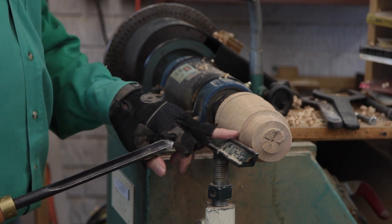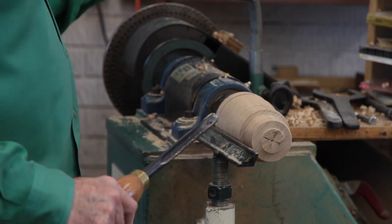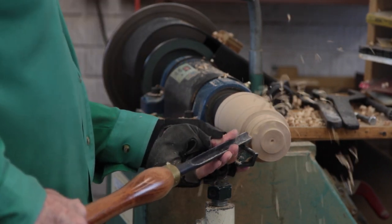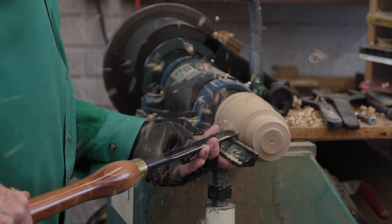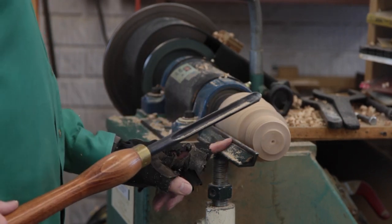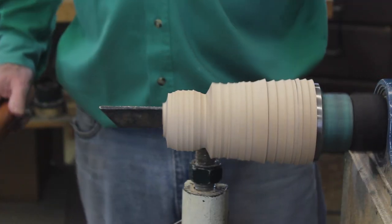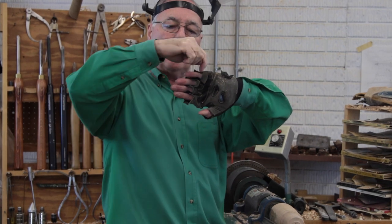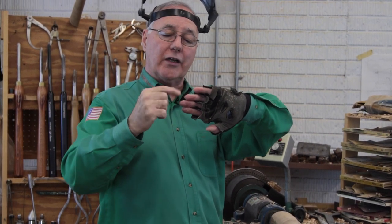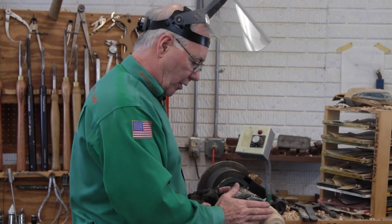While I was hogging off and getting rid of the waste wood, I'm just pushing the sharp edge straight into the side of the tree. I'm going to continue to do that a little bit here to start to develop a shape. That means we need to go from the largest diameter to the small diameter — we're going to go downhill to the fibers as we make our cut. It's always from large diameter to small with the direction of cut. That leaves a cleaner cut than going the opposite way, where each one of those little fibers gets torn out.